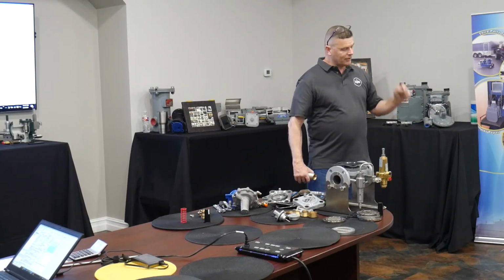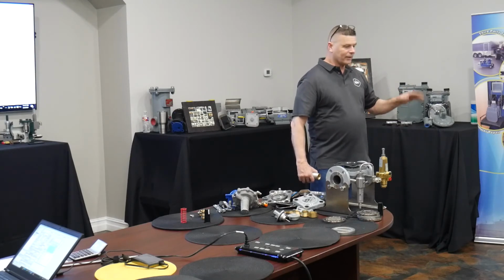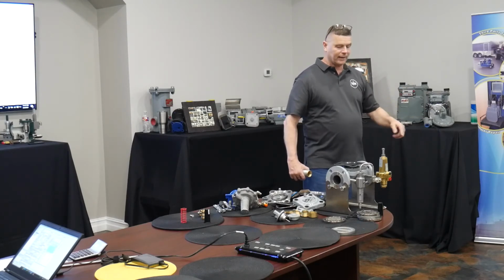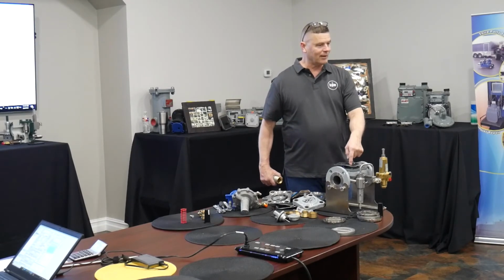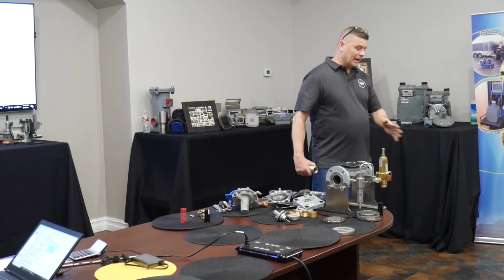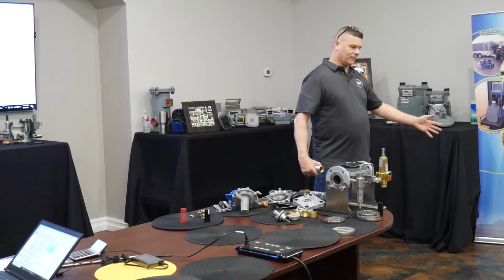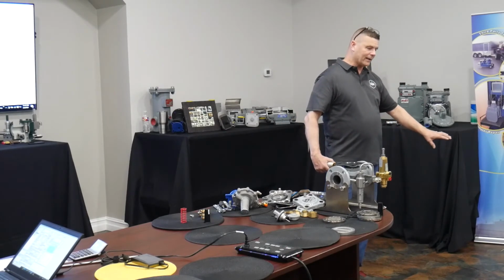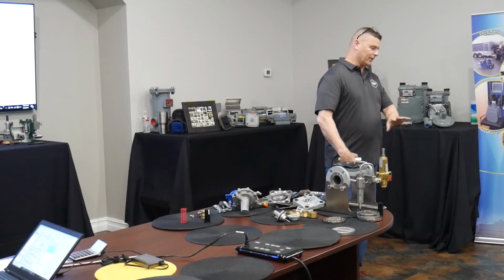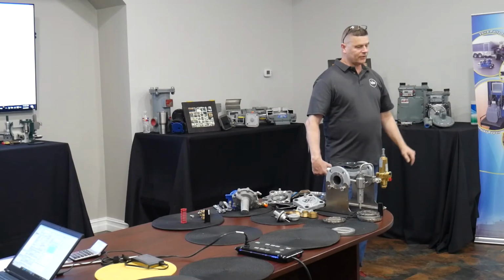And if I put my sense line in an area where the gas is turbulent and the pressure is fluctuating, the pilot has no chance to give you the tight control that is possible if you just put it in a place where there's a few inches or a couple feet where the gas can quiet down a little bit and become more bullet patterned and more laminar. Put your sense line there.